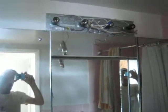So it's a hollow ceiling there, and I think the best thing would be to abandon this cable. Move this fixture to the ceiling, just in front of the cabinet, the vanity cabinet. I think I can do that, with the only plaster repairs being the screw holes for the old location, and the penetration there where the cable enters the fixture out of the wall. But that's about a half a day.